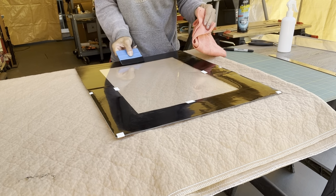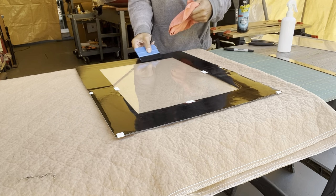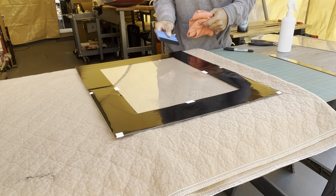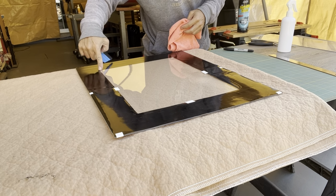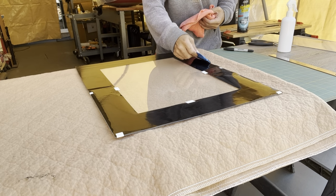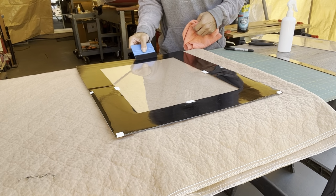There's no rush to do this. Squeeze all the water out. Just wipe it. Simple. Squeeze and wipe. Just pressure it out. Remember, on the edges, you don't want to go this way because you're going to rip the artwork, the vinyl, because you're going against it. Make sure you don't go in reverse, right?